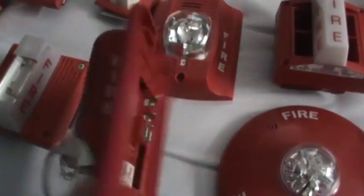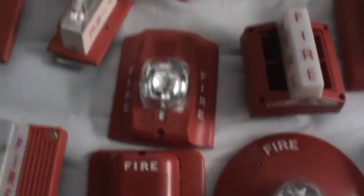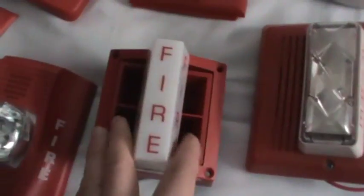A few more that are good for starting out: System Sensor's classic Spectralert. These are extremely common and very easy to wire up — just two wires here and two wires there, and you're done. Then there's the newer version, the Spectralert Advance, which is four-wire but also comes in a two-wire version. The two-wire ones just work. System Sensor Mass ADA — it's multi-tone and sounds a lot like the GOS. There's also an original Mass with a non-ADA frosted strobe, while the ADA version has a big clear strobe on the front. These are fairly common and pretty nice alarms. And I've got a ceiling mount Spectralert strobe here just for demonstration.